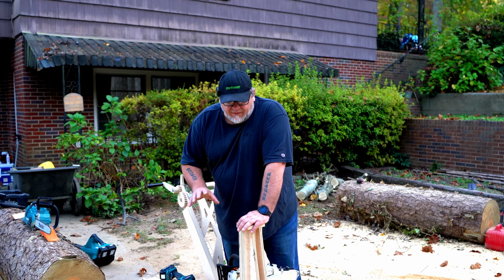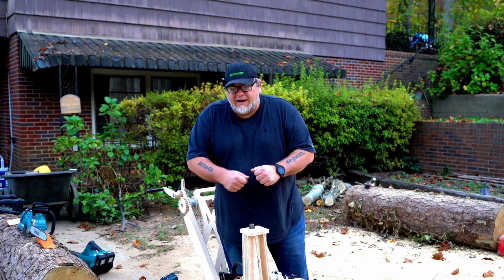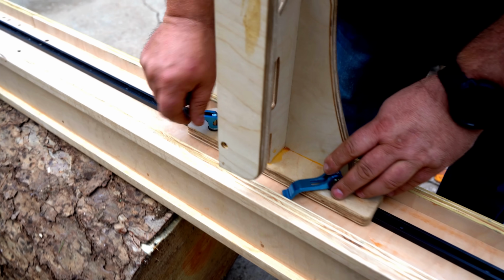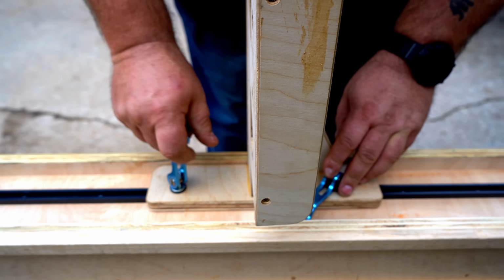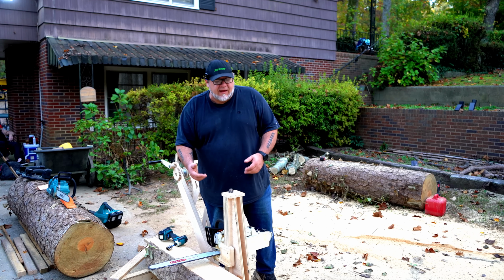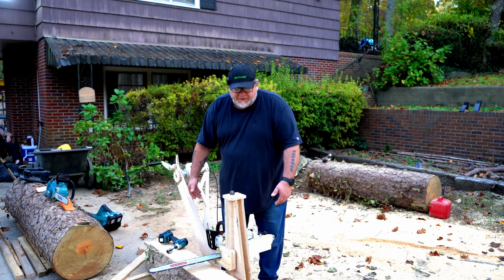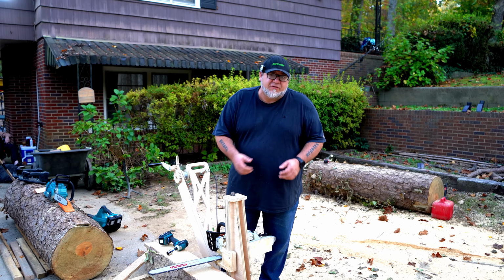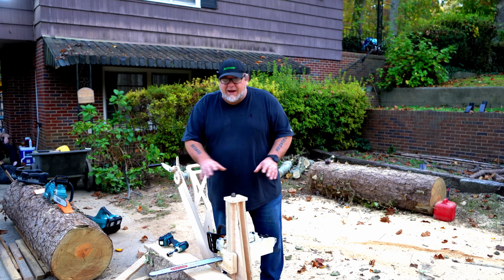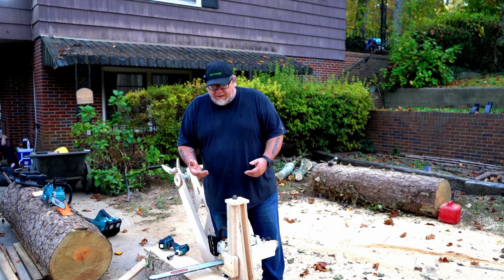The pieces that the logs sit on are only attached in a small, like 2-inch area, and we're using clamps and T-track, and that's not really ideal because it's not a really secure hold. So I've added some angle pieces. That's helped a lot. A couple other things that we could think about doing is making these pieces run underneath the carriage. That would help sturdy it up some too. So it's definitely not a perfect saw, but it's working for what we need it for really well.